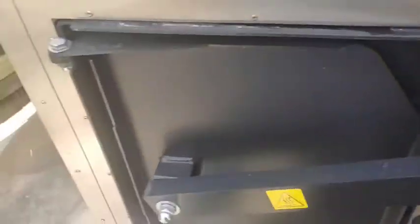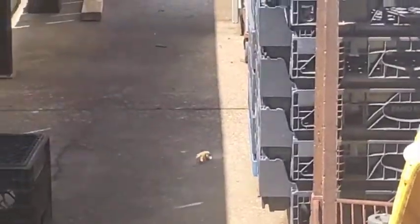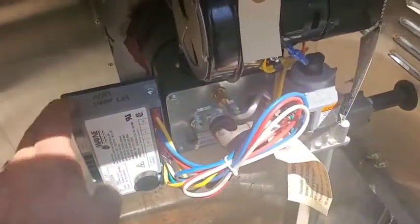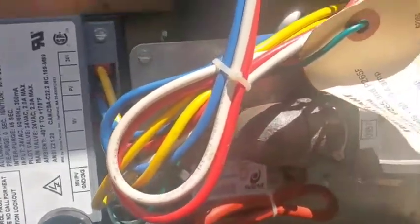See the burner in there? It's not completely brand new — it worked for a little while. Here's the burner looking pretty clean. The pilot's a little extra short. I love that the ignition module is right here — it's a decent setup. It's sparking but it's not lighting.